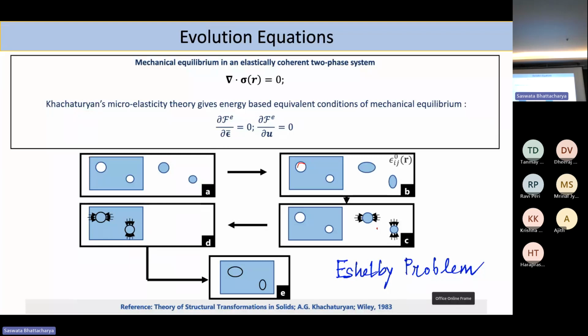Okay, don't worry. And then this one will be sigma x. This is basically along this. If you have a force that is parallel to the surface, what is that called? Shear force. And then you also have normal forces, right? When you write sigma, why are you writing sigma? Because you are taking this area and you have a force. Force by area is stress, and we are calculating something called a stress field.